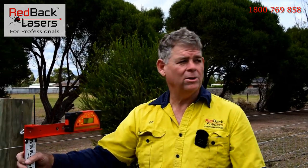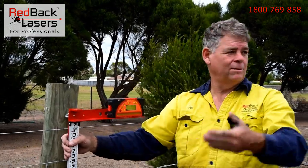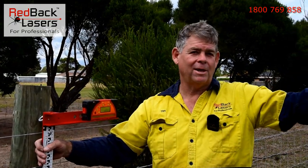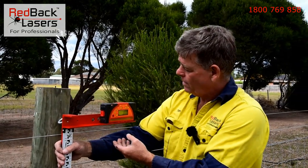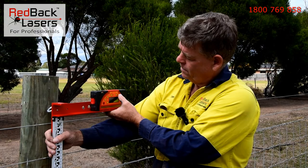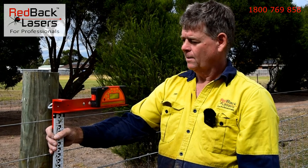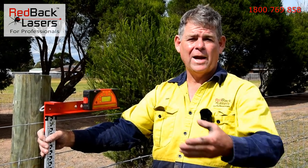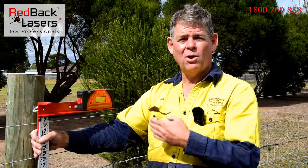We've got our staff in the centre of the post — that's where we sighted off with our scope. The receiver's on my side of the post on the staff, which matches the laser's position on the same side of the fence. That's what I was saying before about making sure that bracket's on the correct side. We're going to turn on our receiver and then hit our channel and our tracking. It's gone to a fast blue flash so we know that the tracking's commenced, and now it's just a waiting game — we'll wait for that laser to track in. We can hear it already starting to find it.